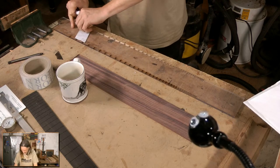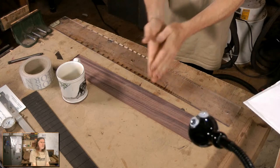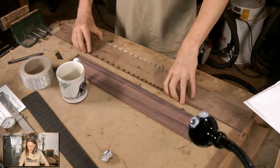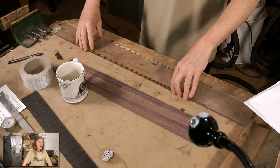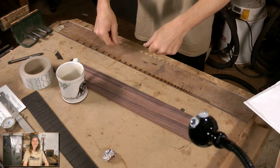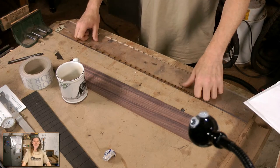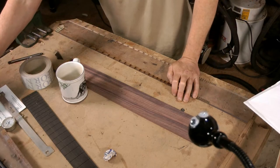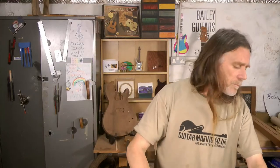So that is NEC tape or exhibition tape, approved double-sided tape. Don't use cheap carpet tape because you'll spend longer actually working with the stuff, trying to get it off afterwards. You'll spend longer doing that than it takes to do your actual job. So, moving on. Actual clamps then. Let's talk about some actual real clamps.